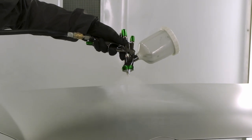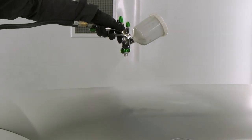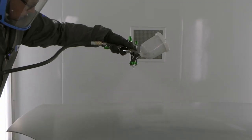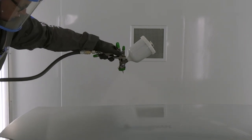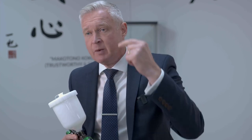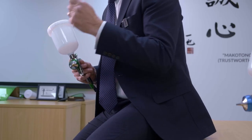On my travels over the last four years, being in all these different climates and conditions, it helped me to understand better the requirements needed for these different kinds of applications. Where I focus most of the time and energy is on the droplet — that atomisation — getting that droplet size absolutely consistent. Predominantly it's also focusing on the pattern and the shape: where that droplet goes into the pattern, the pattern is long and flat and even. The material width is also more consistent, and the top and bottom of the patterns are softer. From the top and bottom of the pattern, you don't get any dispersal or break from the pattern. The atomisation is really tight and really consistent.